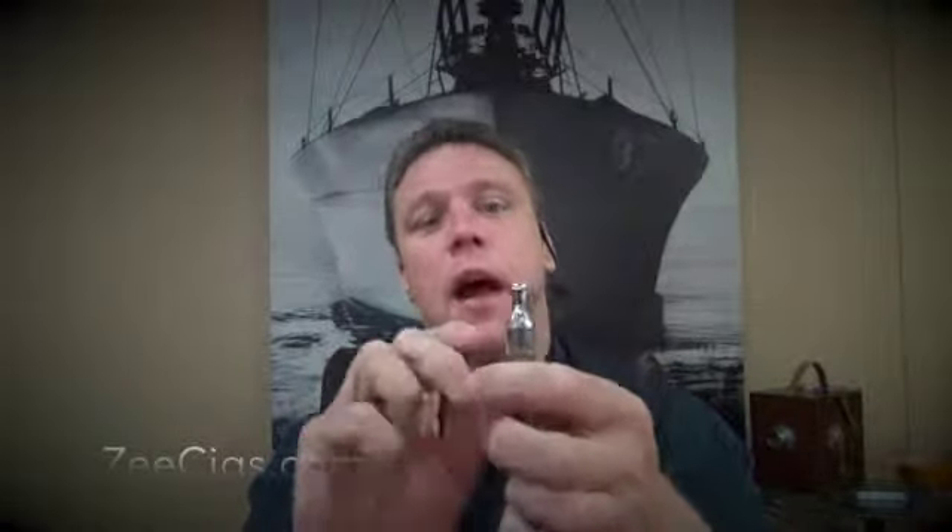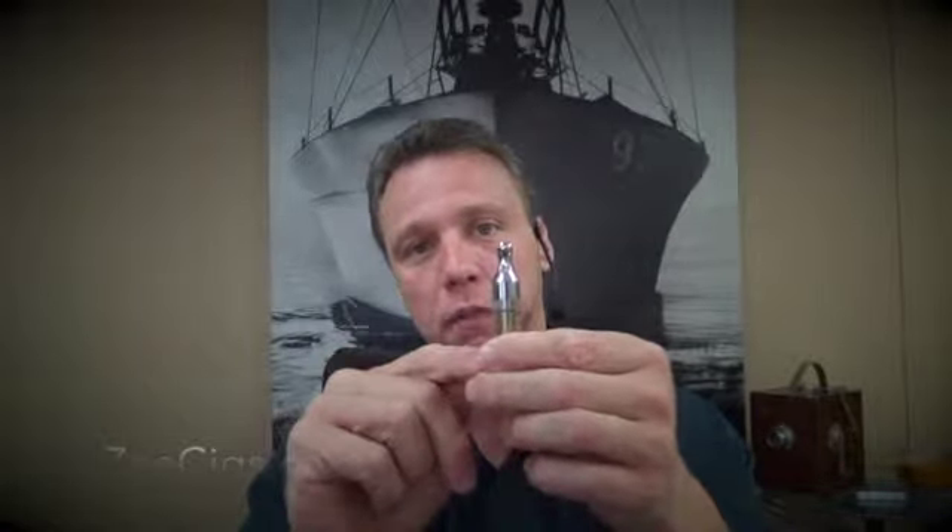The last thing to really mention about leaking: if you do notice a little bit of leakage, before you toss out that old heating element, make sure that the heating element is tight clockwise. You want everything snug, but you don't want it real tight like a gorilla grip — you can damage your system. So don't ever really, really tighten them too hard; you can cause it not to work properly anymore.